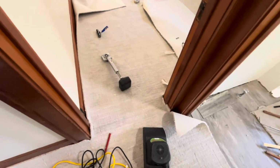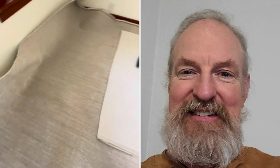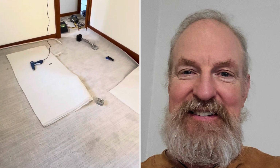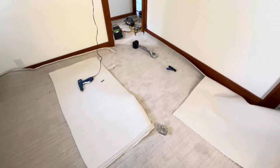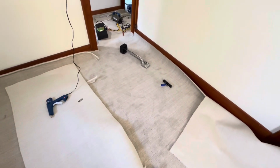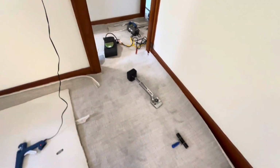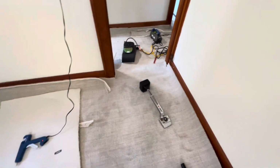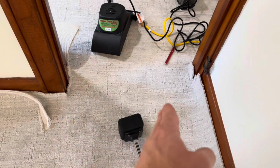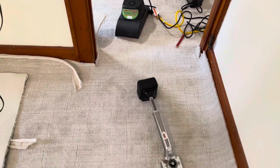Prior to talking to Nate the Great Hall out of Wisconsin, a CFI Master 2 installer, one of less than 50 of these guys, he had explained to me how to go about hooking all your rooms together and then power stretching everything in. So I'm going to do that today, with a pattern piece of carpet.